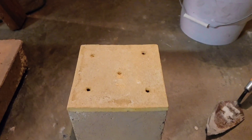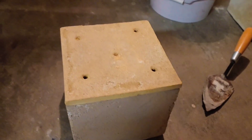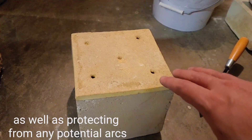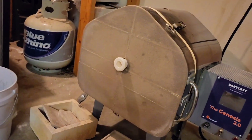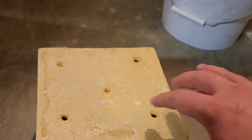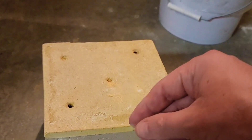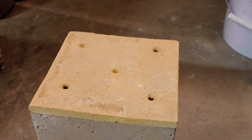The last preparation step for the de-bind is to cover with a lid. You probably don't have to do this, but I do it so that not all of the smoke comes out in the microwave, since this is a much quicker process than it would be inside a standard kiln. Normally that's a very gradual release of smoke, but this lid has a few holes which release some of that gas. The oxygen introduction is actually pretty important for the de-bind phase so that you properly delaminate all of that binder and are left with a clean part to sinter.